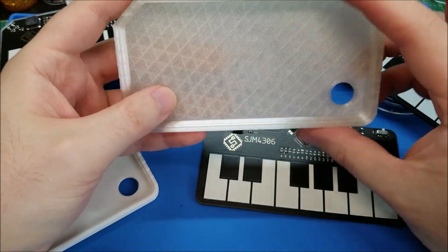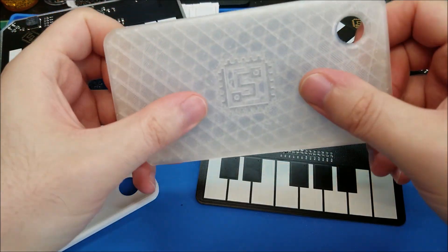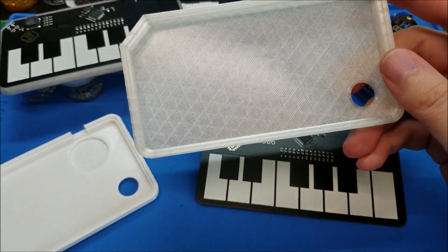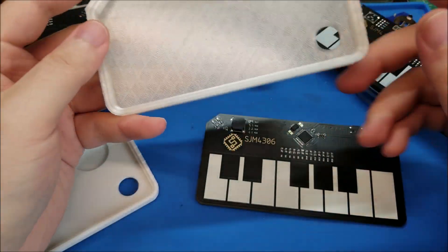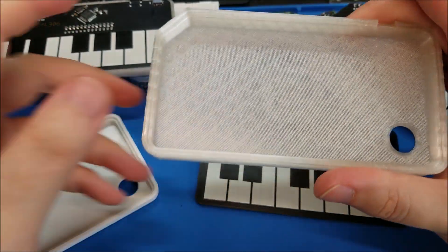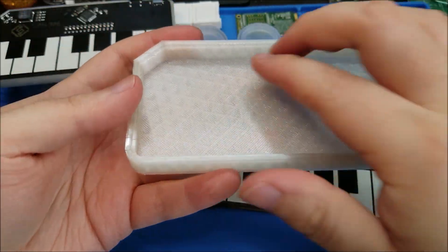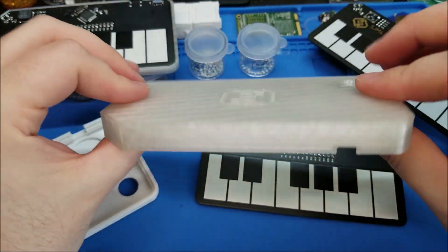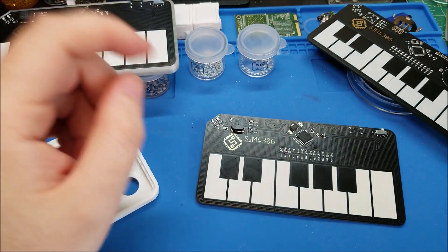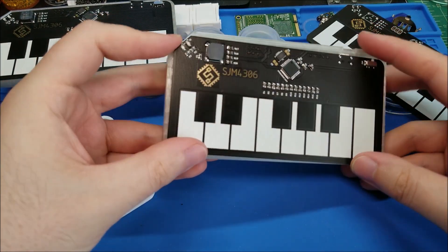This is actually a really nice glow-in-the-dark material, and the thinner version of the case looks absolutely great in it, but I kind of wasted it on this first revision. I guess it makes a good soap dish or tray so I'll reuse it for something. That was my first revision — because I got a number of the dimensions wrong and it wouldn't fit, I knew I had to stop cutting corners and start printing test files.